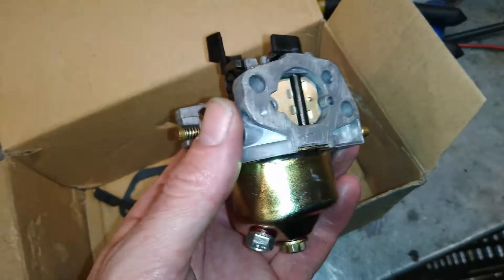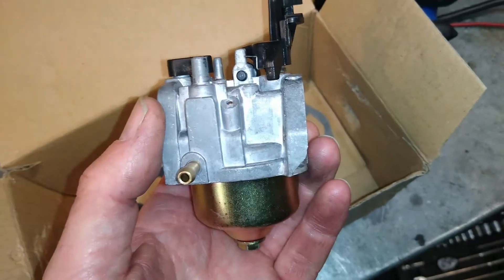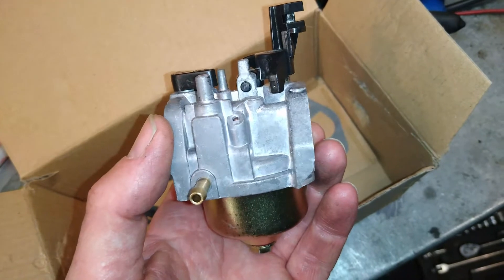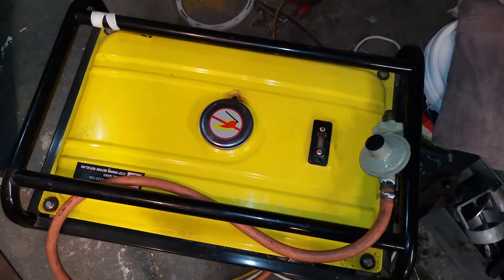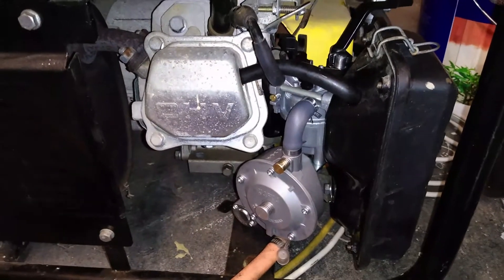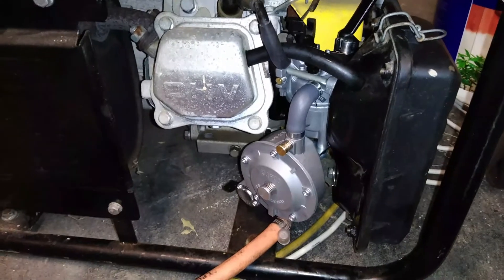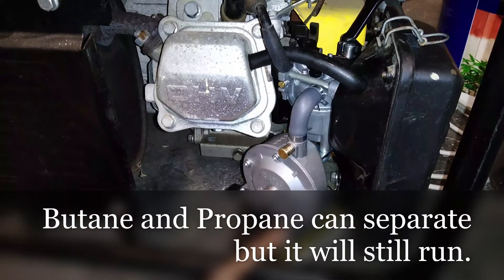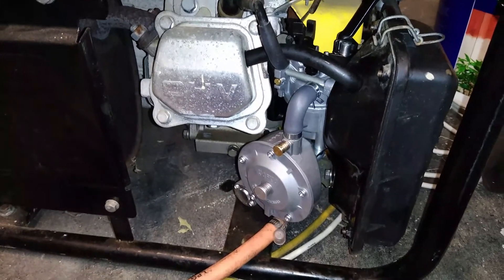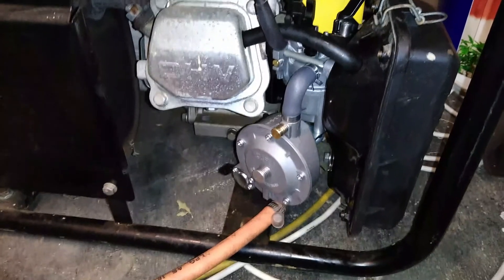I should point out the fundamental reason for fitting a dual fuel carburetor to my generator. Petrol goes off — it doesn't last — you might get 6 to 12 months out of it. If it's been sitting in your tank it just turns into kerosene, goes through your carburetor, gums it all up, and doesn't work when you need it the most. So when life goes to hell in a handbasket and you need your hair dryer, LPG is good — because it never goes off. It can sit in a gas bottle for 10 years. It might separate the butane and propane a little bit, but give it a shake, turn it upside down, and away you go again. LPG does not go off where petrol does. When you need it, there's always a gas bottle around and it will just work. That's the fundamental reason.